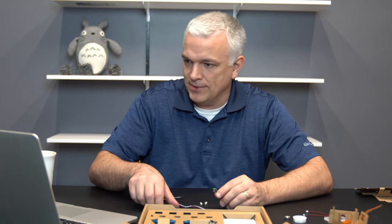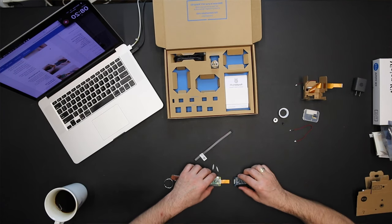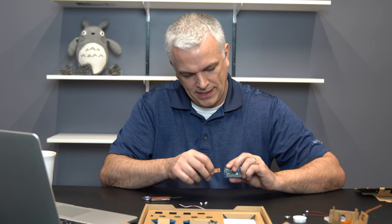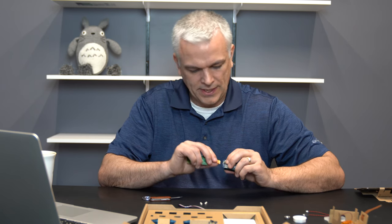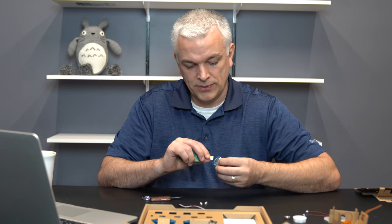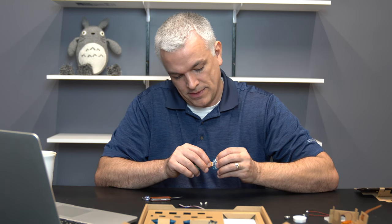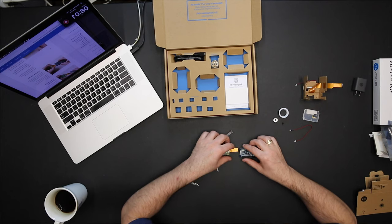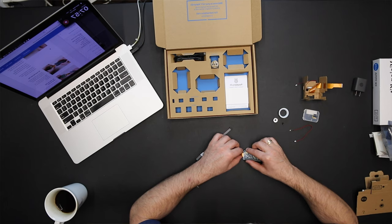That is so dinky. Okay, so small. Insert the flex cable. So we're going to take it like so. We're going to bridge them together with that. So we're going to go in. First of all, I got to aim for that slit there. Okay, remember, copper conductors go towards the board, not up in this case. Okay, so I'm going to put it in. Okay, so I'm going to use the desk as a lever there.